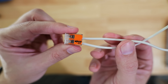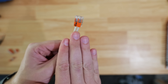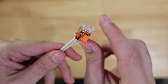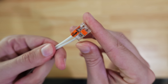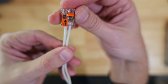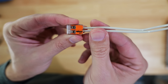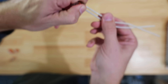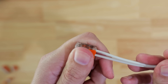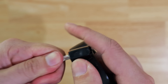That's where I've seen a huge issue: when people go to push these into the back of the box, all they're focused on is getting all their wires into the box, which can be difficult. There have been instances where the levers get caught on wires and, because you're pushing so hard, it will pull the lever up — and unbeknownst to the installer, they think everything is connected when really one of their wires is not secured at all. It's really important to put your fingers over the levers as you're pushing back into the box. Another option is to take electrical tape and wrap it around the Wago over those levers so they can't be pulled up.